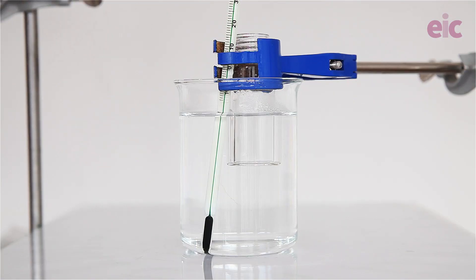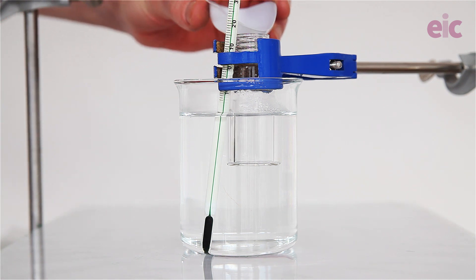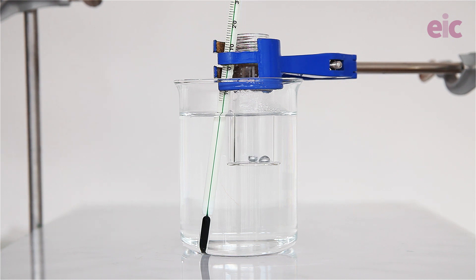In terms of the gallium, you might come across it in chips like these or in little bottles. The advantage of buying it in chips is that you can extract it without having to melt it ahead of time. I'm finding that around 1 to 2 grams — about 2 of these chips — is about right for this demonstration. If you're potentially coming into contact with gallium, avoid skin contact and wear gloves if contact is likely. Make sure you're wearing eye protection. The gallium melts around 29°C, so I've got a water bath at around 40°C to keep the metal well above that temperature.